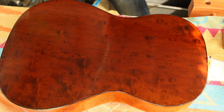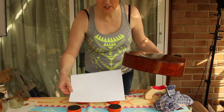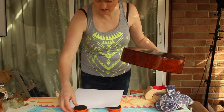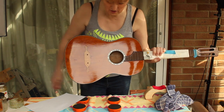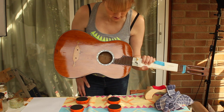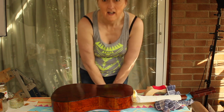Now I'm just going to go over the end again. I've had to put a sheet of paper - thick 160g paper - over the bench cookies. The bench cookies have a sort of serrated, dimpled surface and the impression of the bench cookie has appeared on the front of my guitar. I did some shellac yesterday as you will have seen in the previous video, and apparently 20 hours drying time is not enough to prevent these pressing into the surface. I don't think it's a disaster - it's very very slight and I'm sure 1500 grit will immediately take the impressions away, but it's annoying all the same. So I'm going to do another coat but I've just got to be a little bit more careful.